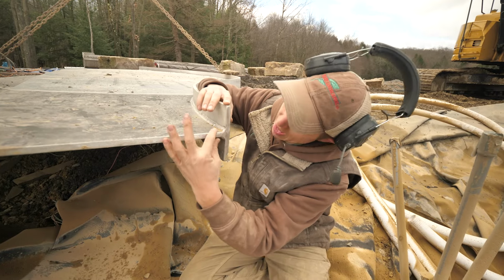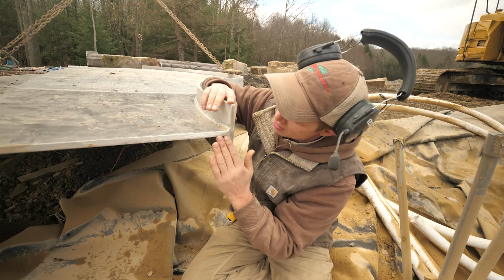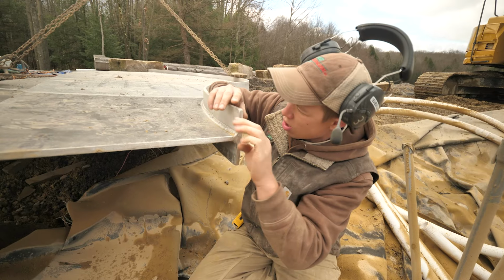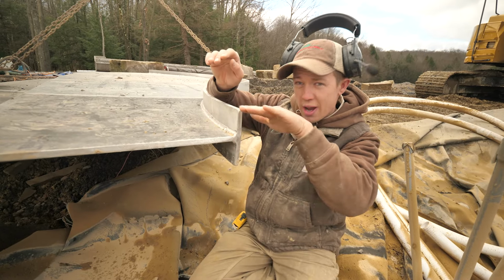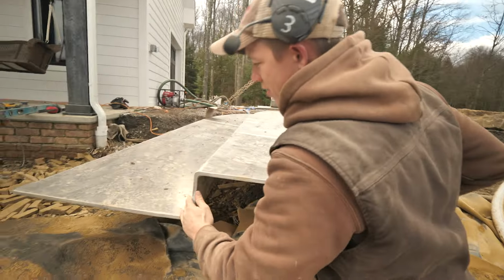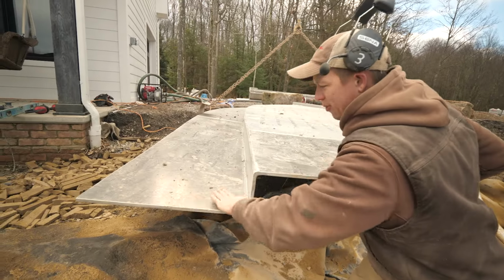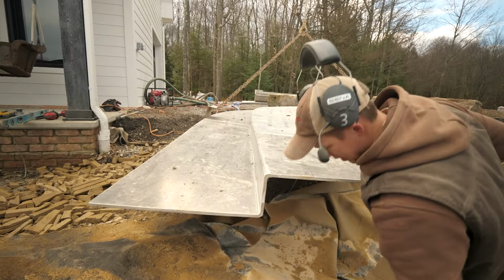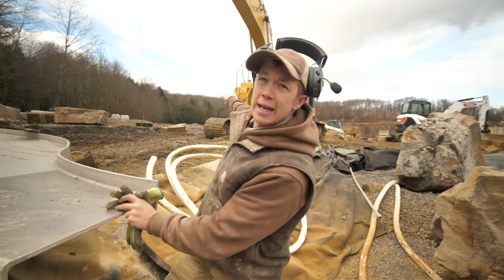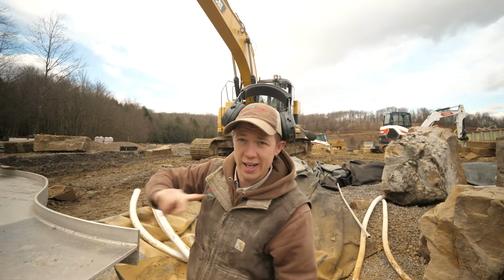And this I had to cut into the block for this. So we're now lying flush here. So I put a 1/4 inch of mortar on the cap and the cap comes in right across here. And then after we go back here, it steps down 6 inches, base sets on top of all of this and that anchors that thing back into the hardscape. So that's how it works. Gonna use my big caddy poo and swing it in here.